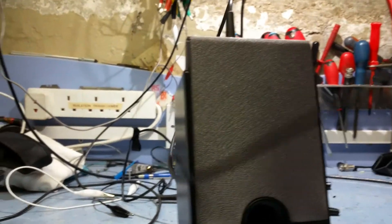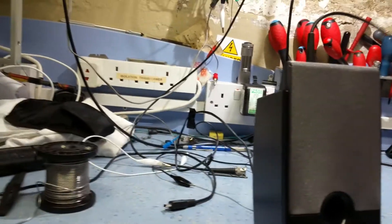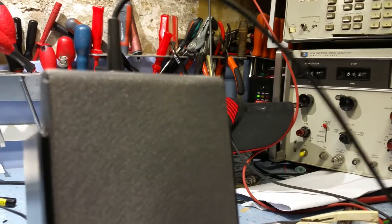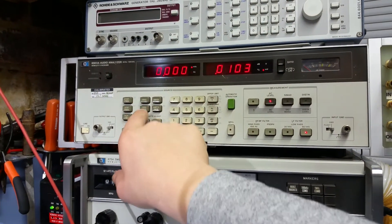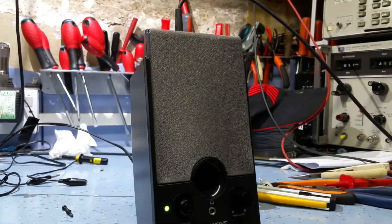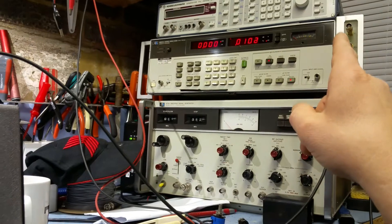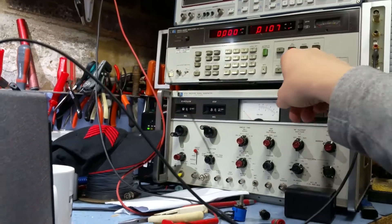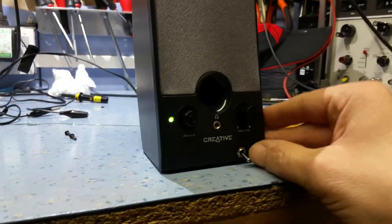Okay, that's it powered up. I've put a BNC socket on the top and I'm using a scope probe here for my signal tracer, which I thought would be quite ideal. Now this is the HP 8903 at one kilohertz and an amplitude of one millivolt. And you can hear that's a perfectly decent volume — it should trace down to around 500 microvolts, no problem at all, and probably even less. That's actually the lowest the Hewlett Packard could go to. So that's the audio tracing mode.